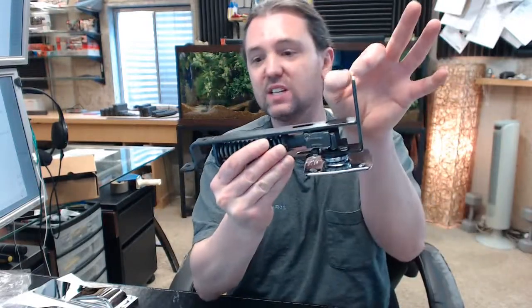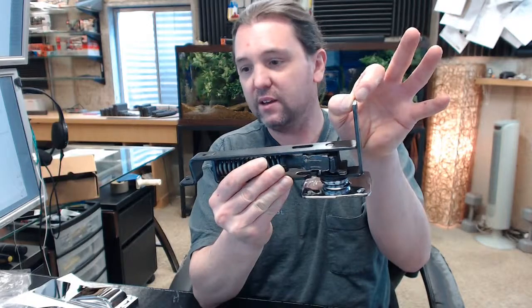Step 3 is probably the most challenging aspect of this installation, but after you stare at it, like I recall very well the first time I did it, I said, well, gosh, that's an unusual cut to do. But when you come to the conclusion, all you need to do is notch the door so it looks like that, and your installation's basically done. So that notch that you see is going to be 5/16 of an inch. It'll give you the rest of the dimensions on how to go about doing this.